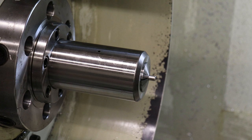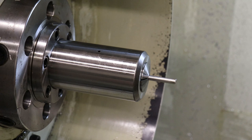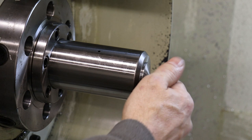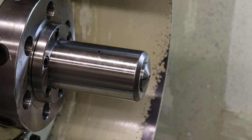Ultimately, I'm gonna do a through bar continuous feed and probably mount a robot onto this lathe to release the collet, have the gripper come and pull the stock out, and then re-clamp the 5C, do all the turning operations, and then use a cutoff tool to cut off the finished part, and then have the robot release the chuck, and then it'll pull out more of like a 6 foot length of this stock, and it'll continue to basically just pull stock through and make finished parts using the robot. So that'll be fun. We'll probably do that in the next week or two. Anyway, so let's start turning down these parts.